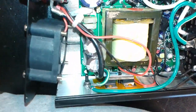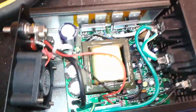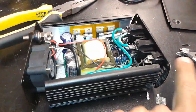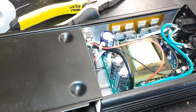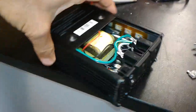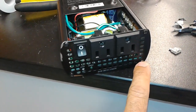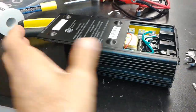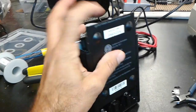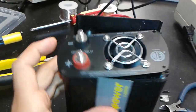Put the grounding wire in place. Hold one part in there, start screwing it, and then slide the cover in from one end. Put your four screws with the lock washers on the plug end, then slide in the cover and finish up by closing the other four screws.